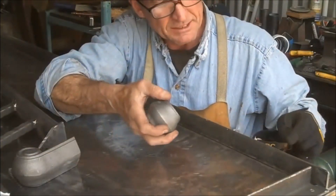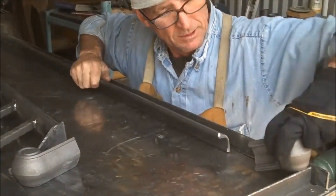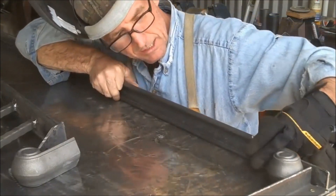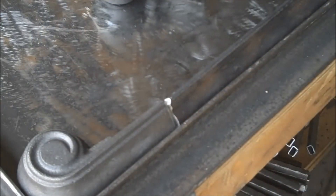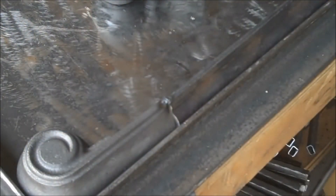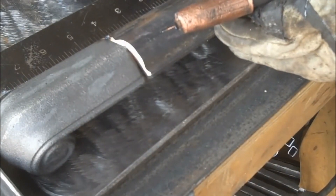After we've got these ground down, we're just gonna use this angle iron that I've got set up here on my table, line this up right here into this corner, make sure it all lines up nice and straight, and then it's time to weld it out. We got it all lined up — just gonna tack it before we weld it off, double check it, just use a straight edge of some type. Not too bad.